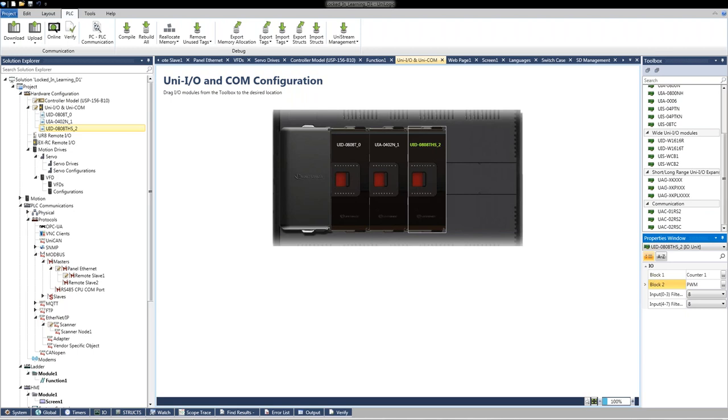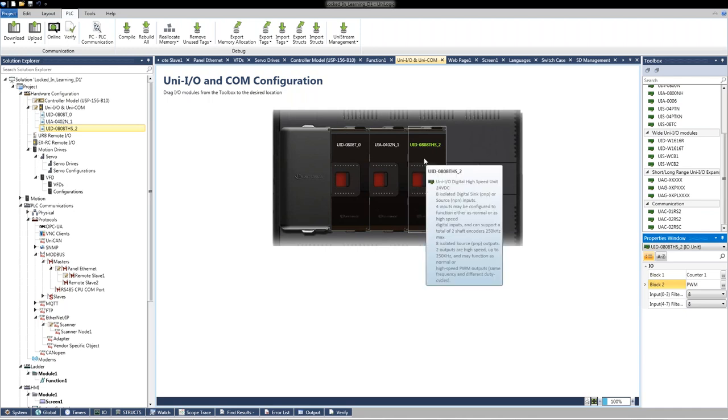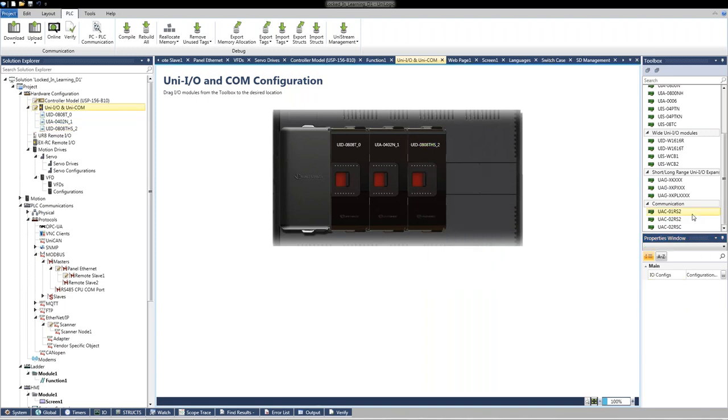Which communications can run simultaneously? All of them, realistically, with the exception of serial. Serial is going to be, you know, channel to channel. A serial port is going to be doing that one thing that you've set that serial port up to do. Ethernet has dozens of sockets, so you have 20 plus simultaneous lanes of communication happening over that one Ethernet port. So one Ethernet plug into the controller, and you could have 20 plus devices talking 20 plus different languages to each other.